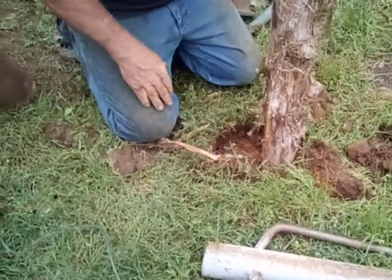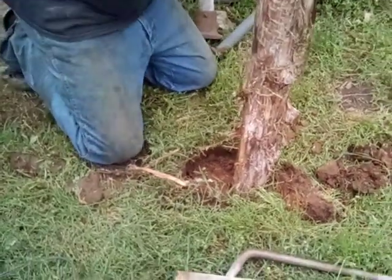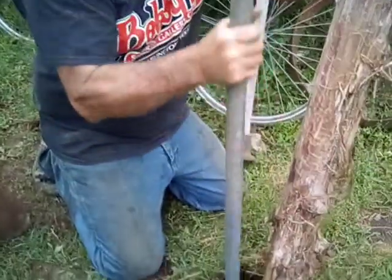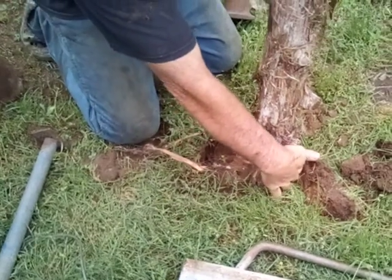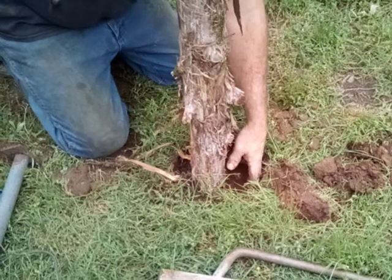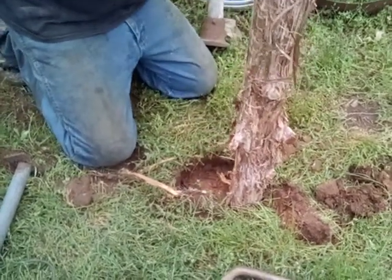And you put it down there, and you start tamping stuff in the bottom of that hole. And here's a tamper that's just made out of a piece of pipe with a square piece on it. And you start tamping at the bottom, and you work all the way up. Well, it's got the natural ground that ain't been disturbed to push against. If you try to tamp all the way around on this side, the dirt you tamped in there is going to squeeze out.